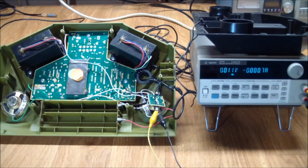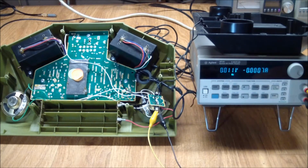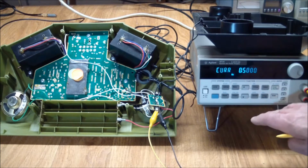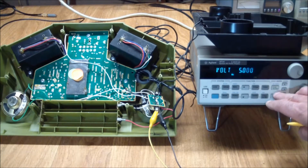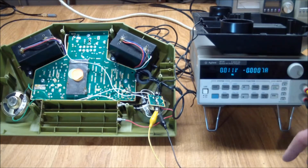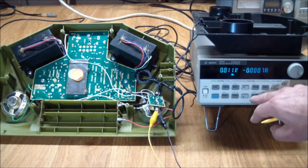So I got this power supply because it's not only going to supply us with power but also tell us what the current consumption is here. So that says 9 volts, so let's go ahead and set the voltage to 9 volts. Voltage, enter number, 9, enter. And the current, it says 200 mils, but let's, just for measurement's sake, open the floodgates and give it an amp.